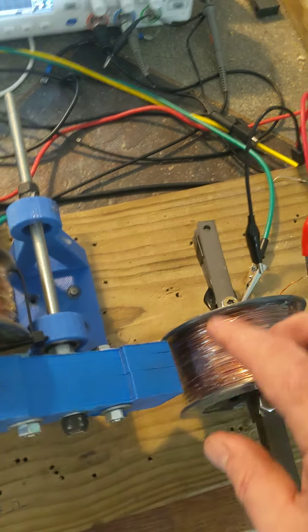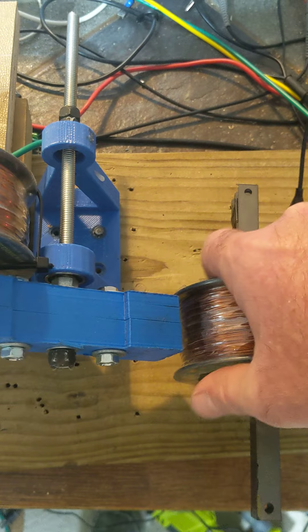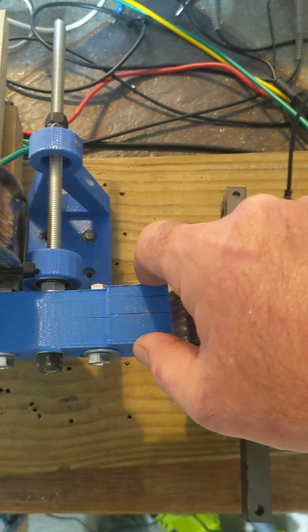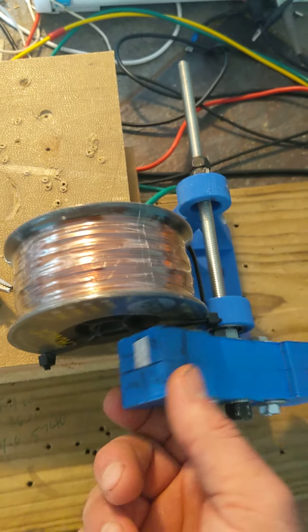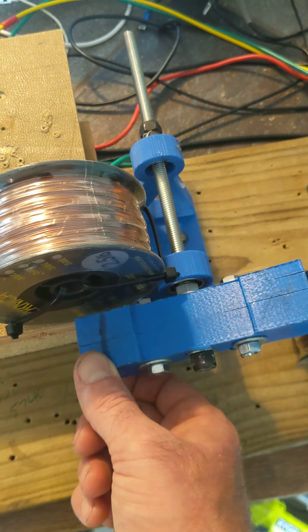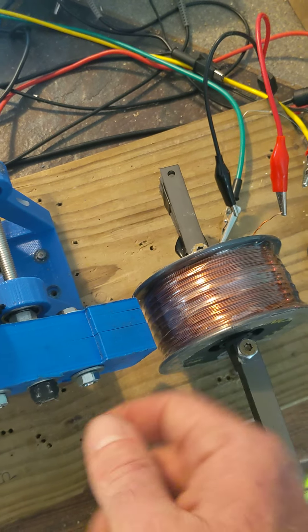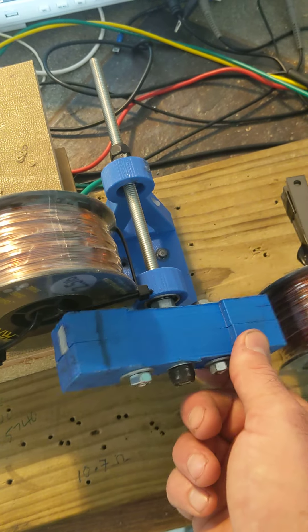The advantage I'm seeing is that this coil has a magnetic field — north and south on either side. That's going to interact with the magnet north and south because it's going like this. It's going to interact with this magnet and it's going to induce much less than this induces. So if they're hooked up where they buck, this side is going to drag at the same time as this side is doing the exact opposite — because this voltage is going through here in series and acting in the opposite manner of the rotor to kick it, as this one's holding it back.